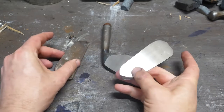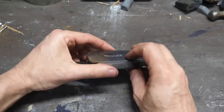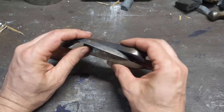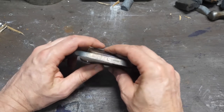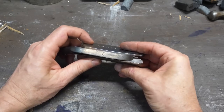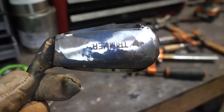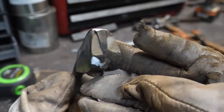I'm thinking about a Sanmai construction where we have these two mild steel clubs on the outside of our hardenable steel club, something like maybe like this. Let's do it. We're going to tack weld this together with a welder, and then we'll put it into the forge, heat it up, and see if we can smash it together.